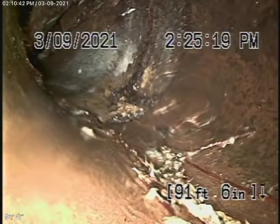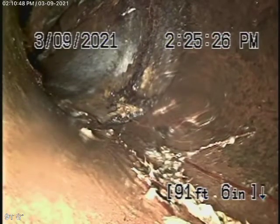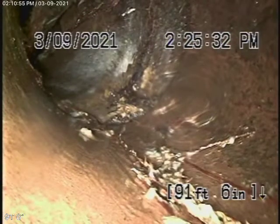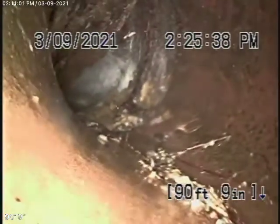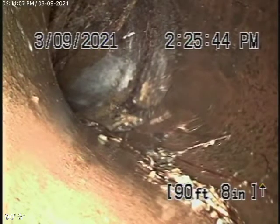There's a little dislocation over here. In my opinion, this is very common. You're going to find this in a clay pipe or cement joint, especially right at the turn. Because of the slight dislocation, we cannot get our camera through there, especially from where we're at. There's a little bit of roots at the end there, and in my opinion it's quite a little dislocated, but it's really not the worst thing I've ever seen.